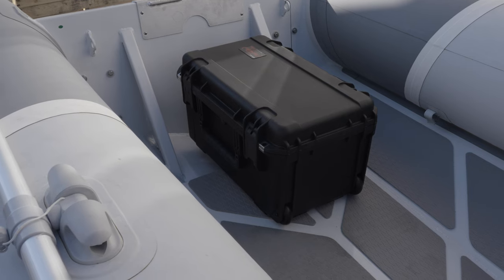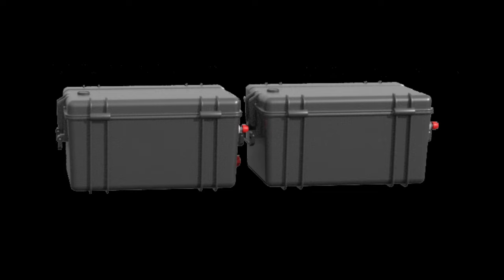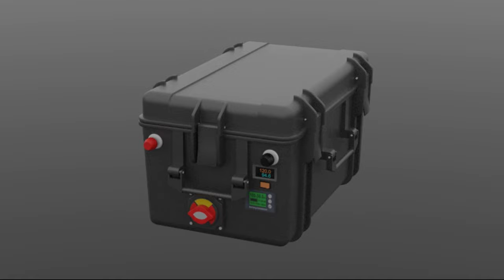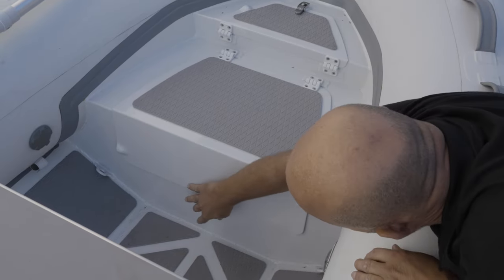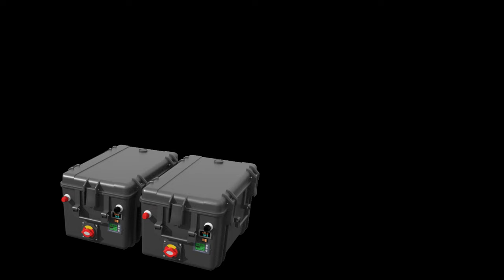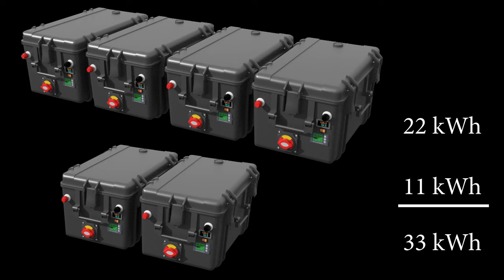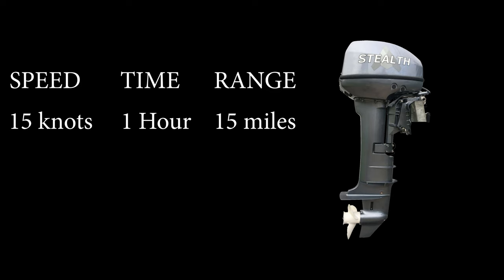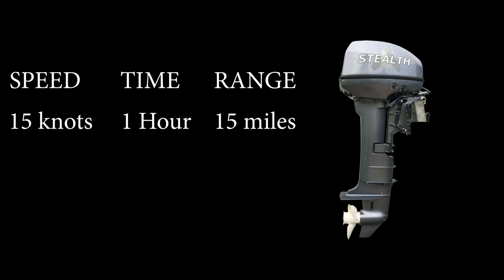We'll soon be making videos about our lithium batteries for SVLynx and Traveler, coming out this month or at worst in January 2023. For now, we have two 230-amp-hour 24-volt lithium batteries built in waterproof boxes, stored inside metal boxes on the tender - one in the bow compartment so two walls keep them from taking ocean spray. On long passages when we won't need our tender, we can tie the 11-kilowatt tender batteries to the main system on the catamaran, increasing our available battery power by 33%. That gives Traveler's E18 outboard 230 amp-hours at 48 volts, meaning we can motor for about an hour at something like 15 knots - about a 15-mile range, which is plenty for our needs.